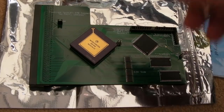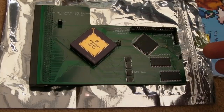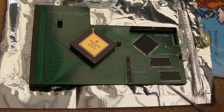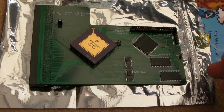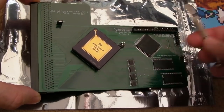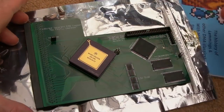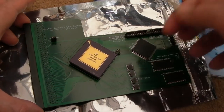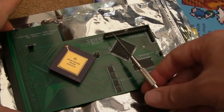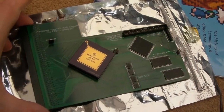Now, don't expect you could buy them built at that price, because obviously someone's going to take an hour or two, or three maybe, if they're doing extra tests and things on it. So you might be expecting to pay, I would say, between £120 and £150 for something like this. Bear in mind, it runs at 50 megahertz. Try and find another 1200 accelerator that is cheap and affordable, less than £200, that runs at 50 megahertz, that has either 64 or 128 meg RAM with EHIDE, PIO mode 4 IDE. You're not going to find one.